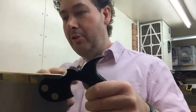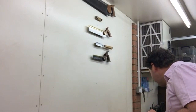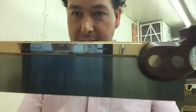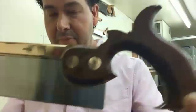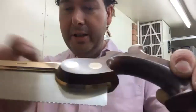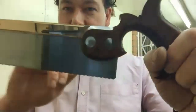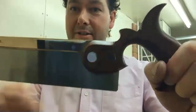So what we've done, looking at this design and to change things, which, like I say, hasn't been changed for over 250 years, is we've got designs like this. So this is the Chippendale saw that we make. You can see that, stamped with Chippendale's signature, fluted back. Now you can see on this saw, if you look underneath, this is made of bronze, but this back is actually all one piece going all the way around the front there. So there's no influence of that woodwork. The handle isn't actually doing any alignment whatsoever. The back is the full alignment.